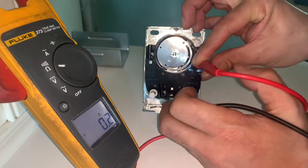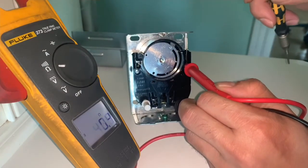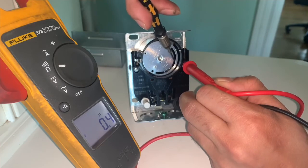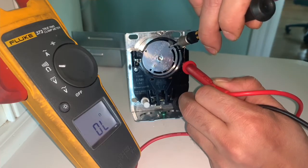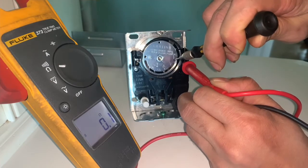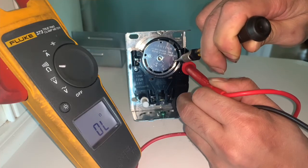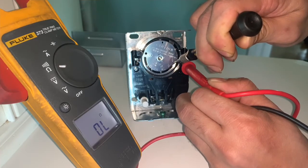It's supposed to make this sound. This one will only open when the furnace is really hot — up to 180 degrees or 200 degrees, depending on the settings on the third dial right here. If you spin this dial around, the second click is the high limit, meaning the furnace reaches 180 or 200 degrees and has to shut off the gas valve.